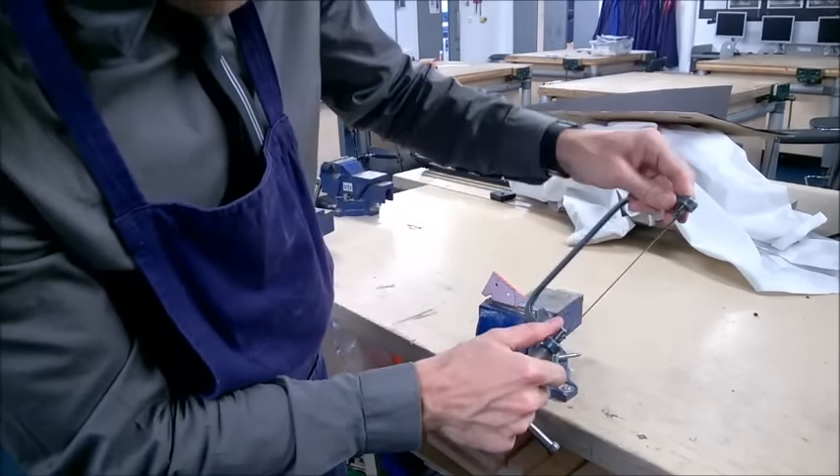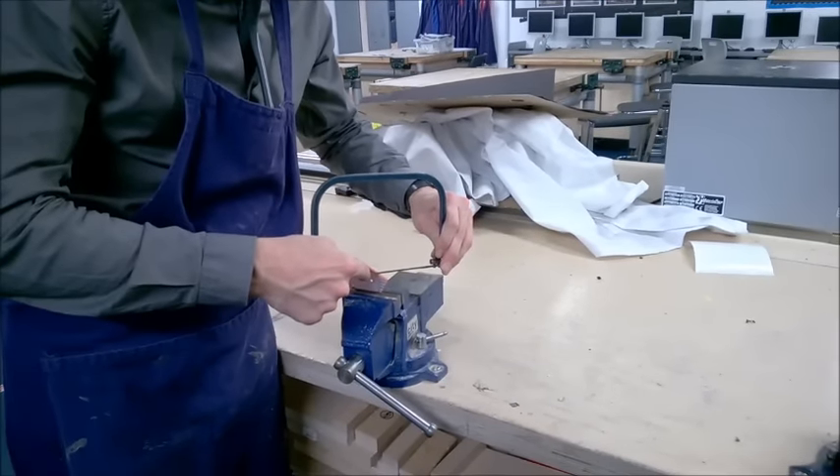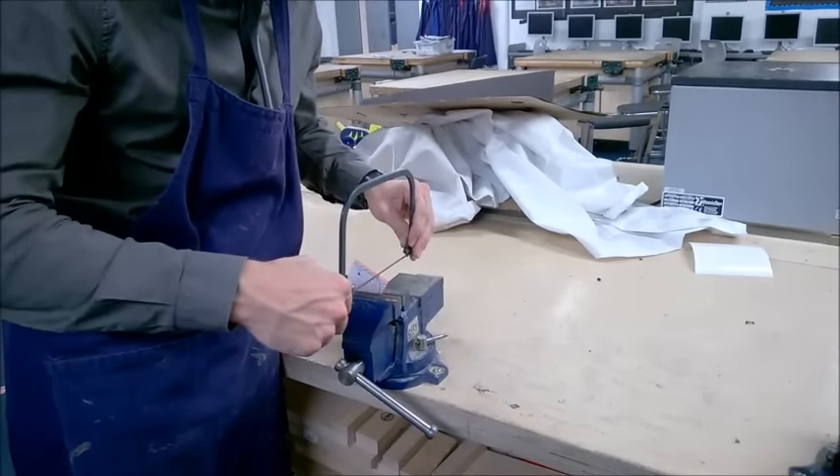When addressing the work and placing the saw on it, pay attention to the cutting angle. Most of the time I want the blade held at 90 degrees to the edge of the work — making a right angle. I don't want to hold it tilted forward because the front surface will be larger than the rear, and I don't want it tilted back either. I want both surfaces to be cut at the same length.